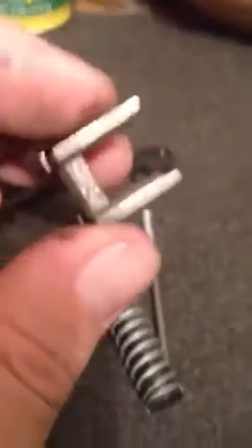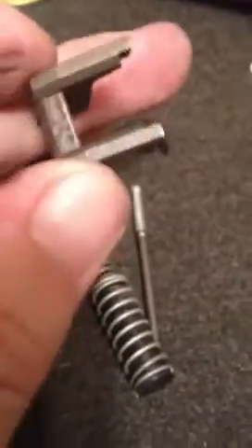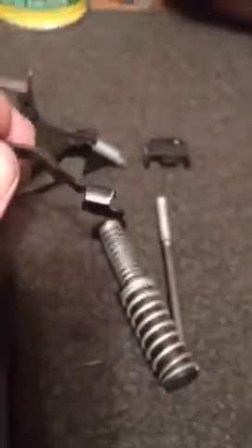We're going to polish this surface. Your lock block — you got your Dremel tool out, you got your metal polish out, polish this. Your slide rides right on these anyway, so polish it up. Do yourself a favor: change this little guy to an extended slide release. Just makes releasing the slide a little easier.